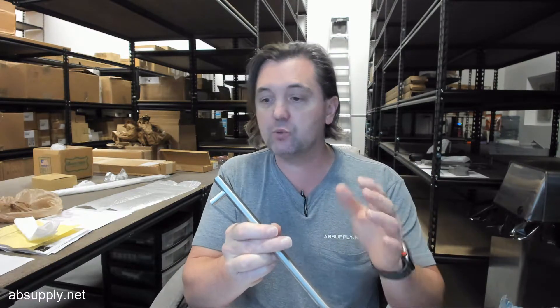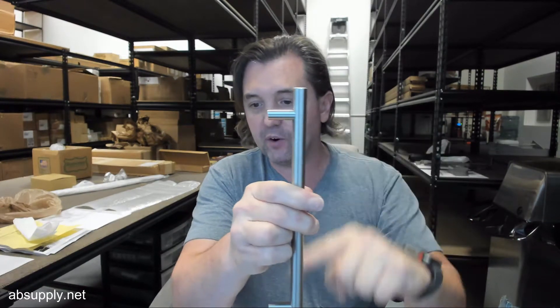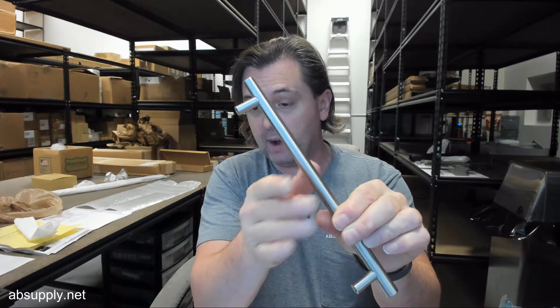The balance of the extended description covers: straight small mount post for cabinets, casework, closet doors, etc. Square ends, half inch diameter, center to center varies based on your needs. Stainless steel base with a satin or polished finish. Fasteners: 8-32 by 1 inch, truss head machine screw — likely a pan head. If you need back-to-back mounting, the RM-1210 can accommodate that, as it is a larger diameter pull and the thicker material allows for a back-to-back mount option.